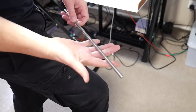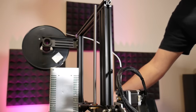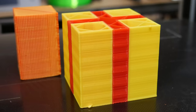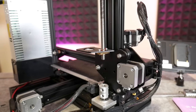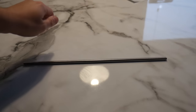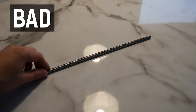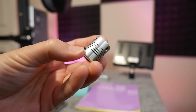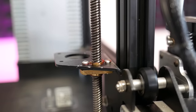One is a bent lead screw. You'll know if you have one because you can see it moving eccentrically, and it also creates a very uniform pattern on your print — as it moves up in Z you see this uniform pattern of misalignment. A bent lead screw will quickly ruin everything and you can't fix it, you just have to get another one. To check, run the printer up in Z, pop it out, and roll it on a sheet of glass or a flat benchtop. If it's not bent, it might be the print coupler or that Z-axis coupler. Sometimes they're damaged in shipping. It might also be the Acme nut that secures to the lead screw — sometimes it's fixed at a weird angle or it's loose. All these things can give you accuracy issues around your lead screw.